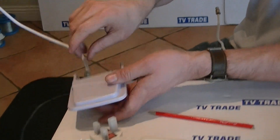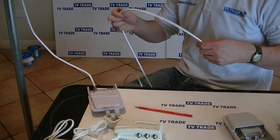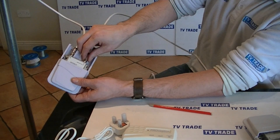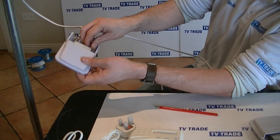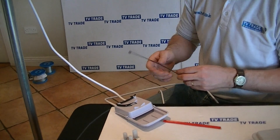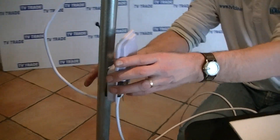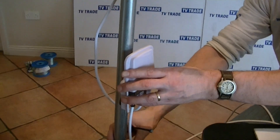Now I'm going to take a second cable from here that I'm going to run into the house and it'll feed directly into the power unit inside. I have a pre-terminated cable — this cable normally would be considerably longer and then run into the power unit. I'll just repeat this on the far side. At the back of this mast amplifier there's a tie wrap that comes with it that allows it to be attached to a pole. I would just belt it on like this and then use a tie wrap like this to secure the cable on the way down.